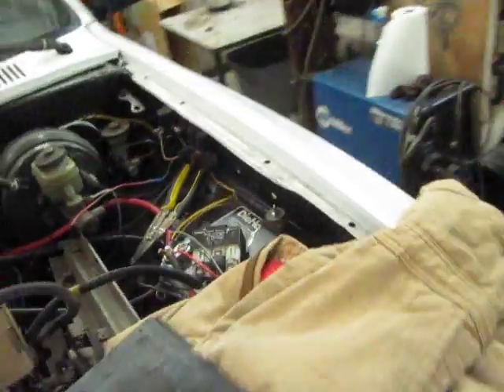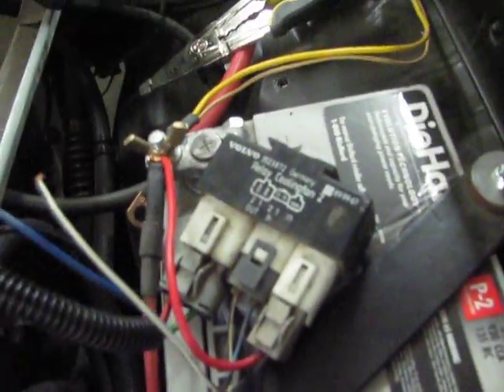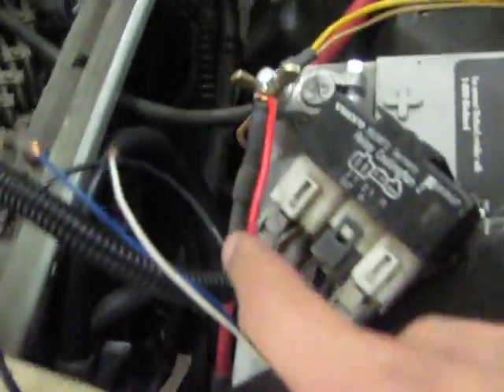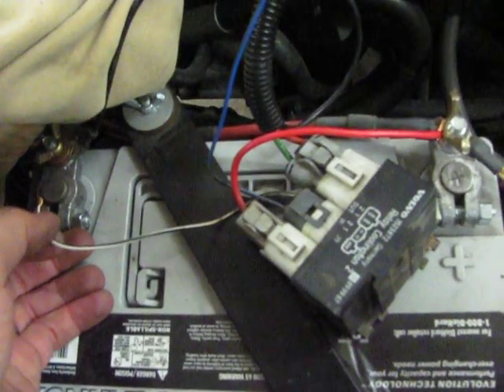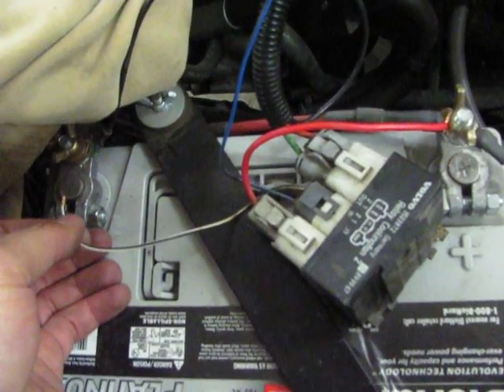That's a neat thing about this controller — it's very much OEM style. The fat wire goes to the positive, the fat black wire goes to the negative. It's actually designed for a chassis ground, as you can see from the tab there. And then there are two wires here that turn it on and off, and in this case it does use a ground to turn it on and off, so I can use either one of those switches.